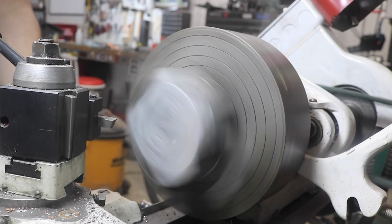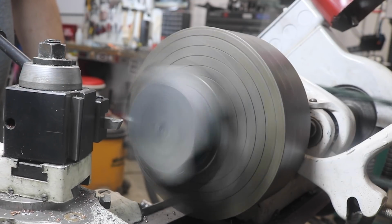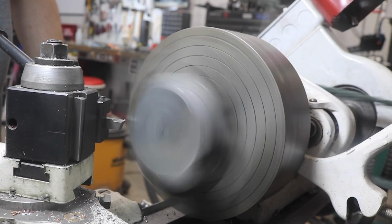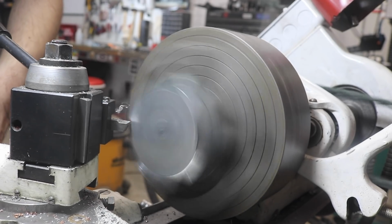After the stock comes off of the saw, I'm using the four-jaw chuck in the lathe to true up the cut faces. I'm not very worried about making the workpiece centered at this time. This operation is just to square up the two sides to proper thickness before layout.